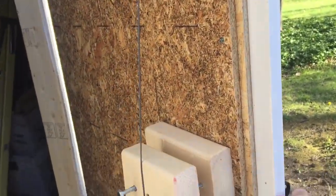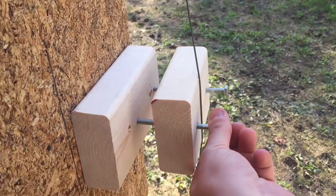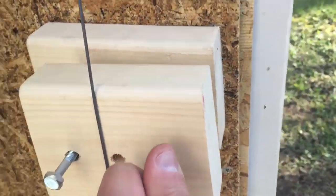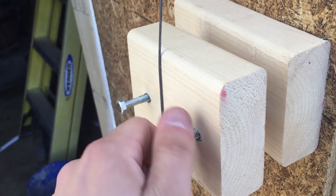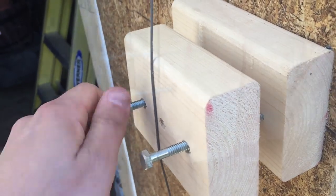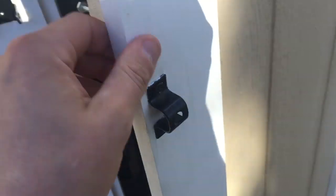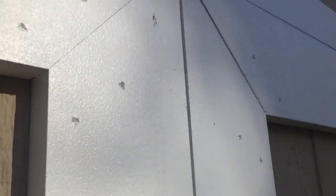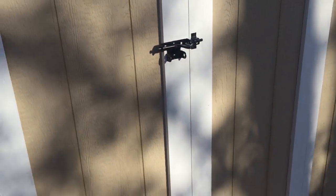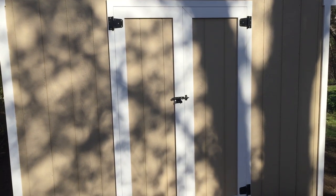That's the way. So the question is, if I take this stuff off, is it going to stay? Let's loosen this. There's not as much tension, so that's a good sign. It's kind of easy to loosen these. I took all the tension off this. Let's close it and see what happens. Perfect. It worked. Now I can take my contraption off and hopefully the door will stay like that. If not, I'll know how to fix it.